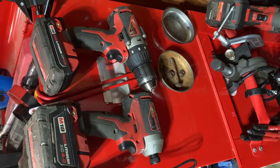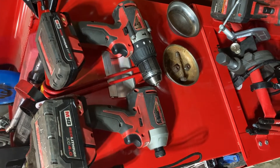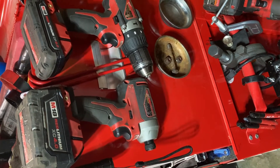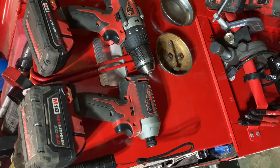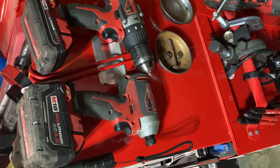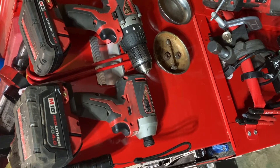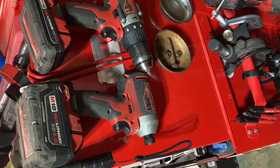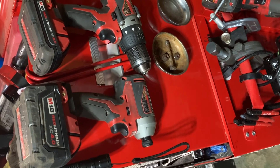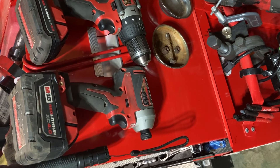So that's how you drill out a knockout hole — that's not really a knockout. I bought the aluminum box originally thinking they were knockouts, turns out they weren't, so I just drilled them out with a hole saw. You can get an actual tool for drilling out knockouts, but I don't do it enough to make the tool worth it and I had these hole saw bits laying around. You can do this with any kind of box — an electrical box, a panel box for a house — anything that has non-knockouts that you need to drill, you can just use a hole saw bit and a piece of conduit and it works just as well. Please make sure to like and subscribe if this video helped you out — thanks and have a good day.